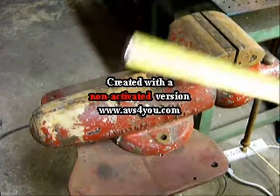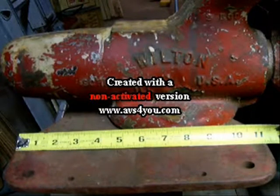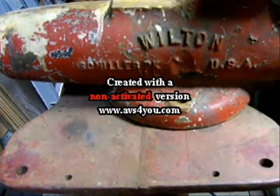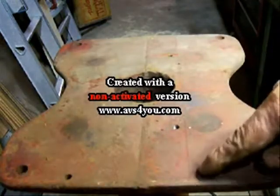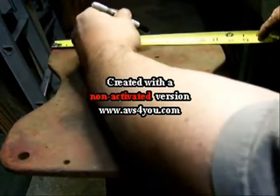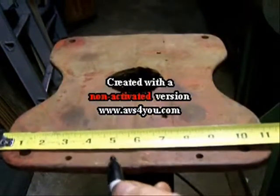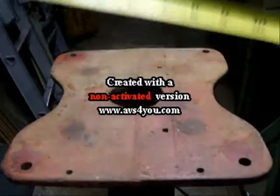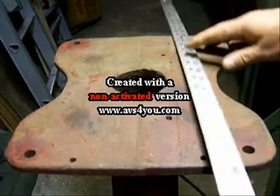That's a pretty good location right there. I'll need to take a measurement to the center of the hole. So the hole is 7-3/8ths from the far edge of the table top on the pedestal. Now I'll need to get the Wilton vise off the pedestal so I can make my first line that the vise is going to be centered on. I'll make my first mark at 7-3/8ths here and another mark at 7-3/8ths down here, and then use a straight edge to connect the two. That's the line the vise is going to sit centered on.